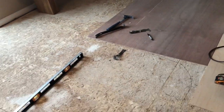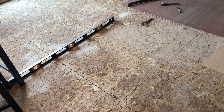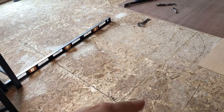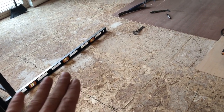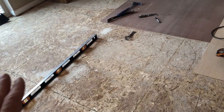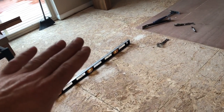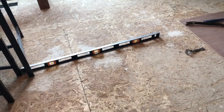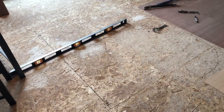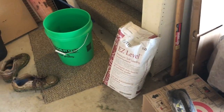The Luan is going to go over the dip when it dries. I'll nail all the way around it but not into it so it doesn't start cracking. Next I'm going to mix my liquid leveler in a bucket, let it spread, then spread it with a trowel to get it sitting right. When it's almost dry — about 15 to 20 minutes — I'll lay my leveling bar on it to check. If you think you just pour it in and magically have a flat floor, that's not how this stuff works.